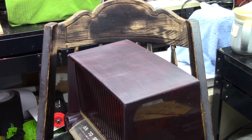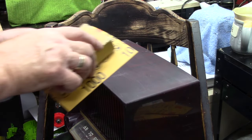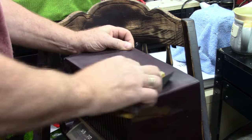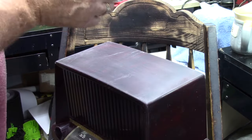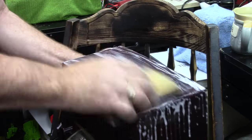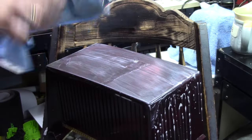After a complete cleaning upstairs in the sink, I got out my wet and dry 1000 grit sandpaper and proceeded to start sanding the cabinet. After a few strokes, I realized that dry sanding was not going to hold up and cut it — I was blocking up the paper. So I went ahead and got a soapy water mix, sprayed it on, and started sanding that way. This was quite a tedious and long process and I've sped this thing up just to save you guys the pain.